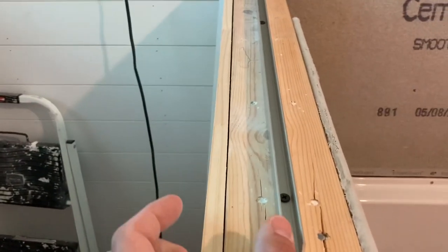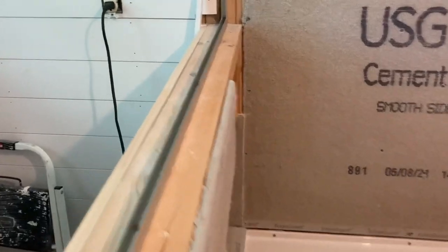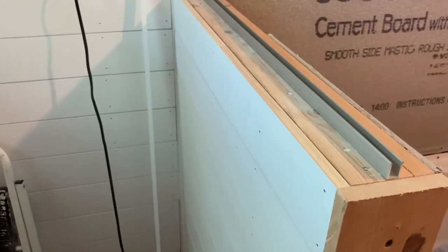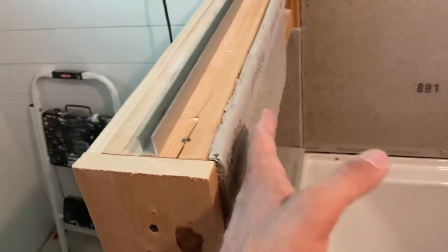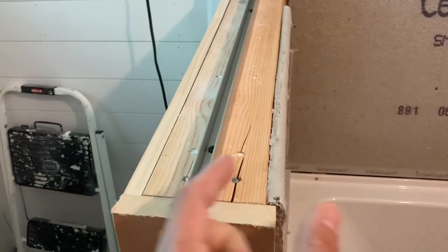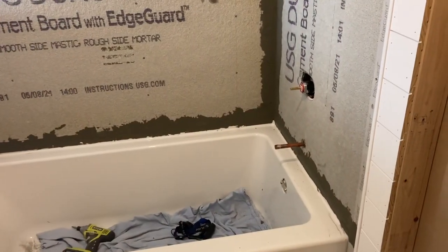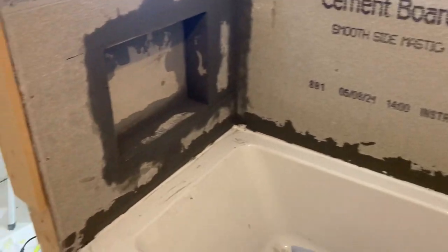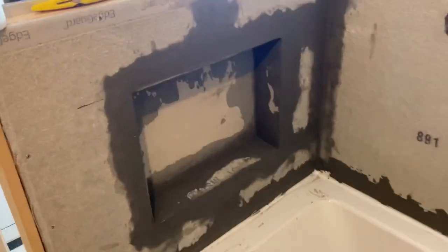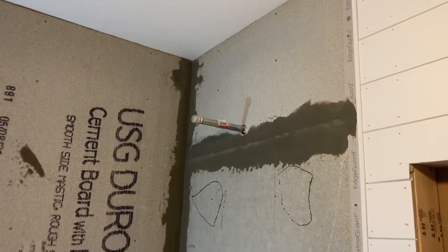There's going to be two little strips of marble hanging over on either side of the glass. I was trying to get to a more finished edge so they'll know what that distance is when they measure tomorrow. I'll have to account for the tile thickness when they take measurements, but I'm thinking we'll make it the same distance on both sides even though the overhang might be shorter on the tile side. Got the joints on the backer board mudded this evening, including the shampoo cove — probably the trickiest part was getting all the fiber tape in there on all those seam corners.